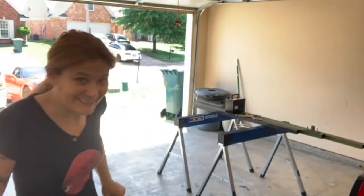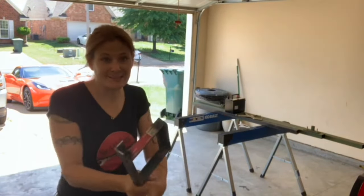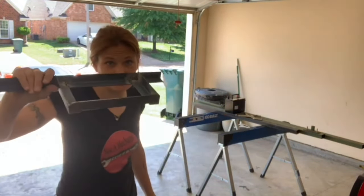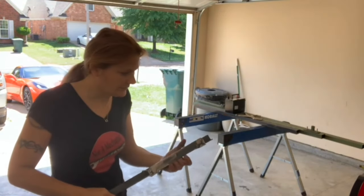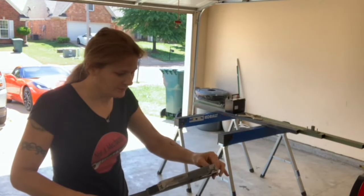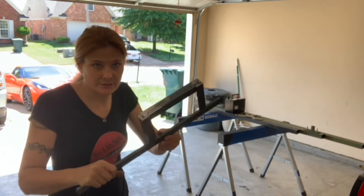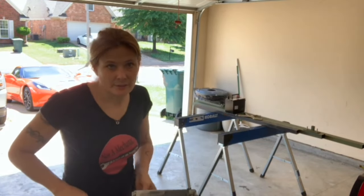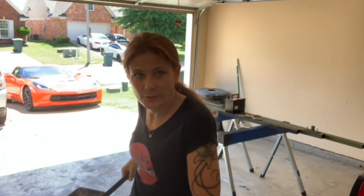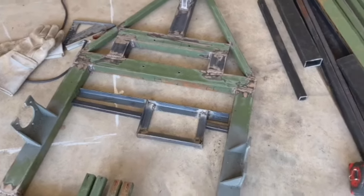Out of this garage today. I got stuff everywhere. But this, I made a battery box out of some angle steel. I call it angle iron, but anyways. Need to grind out the insides a little bit and then weld it 3.5 inches from the back so it doesn't interfere with the sprocket. So it's gonna go right in there, something like that.